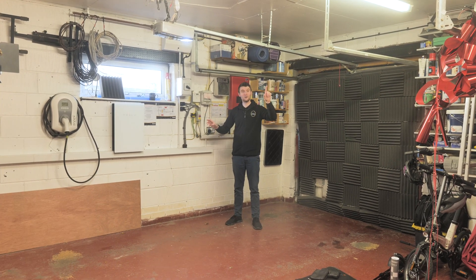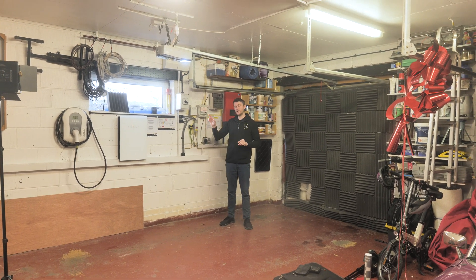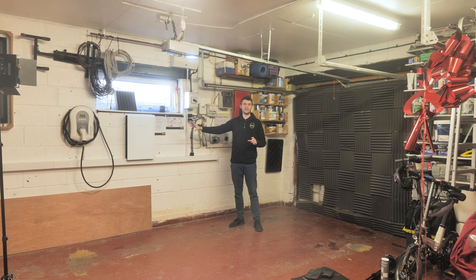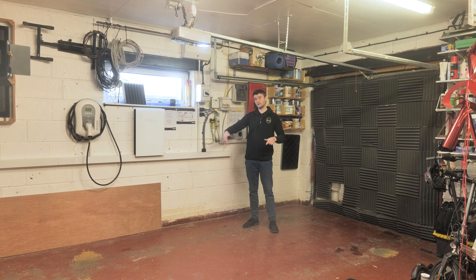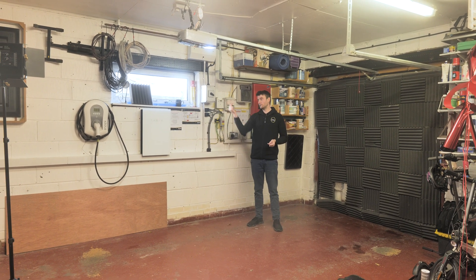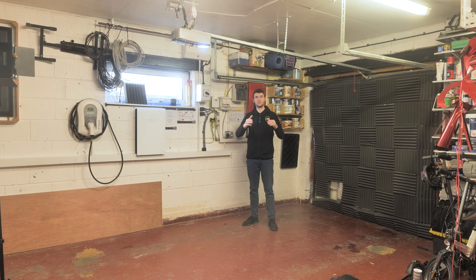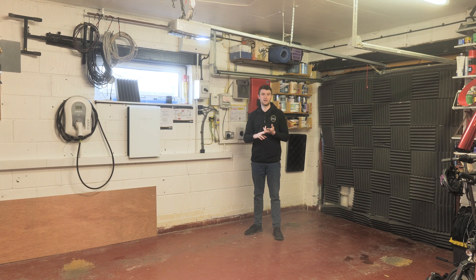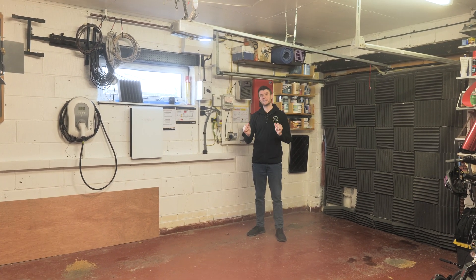That's clicked. It was so quick — the lights haven't actually gone off. That's fantastic. So now we are running in off-grid mode. I heard a click inside the gateway, so it has isolated the grid from the system and is now drawing power out of the battery to feed the house. The internet's probably rebooting — it might even have been so quick that the router hasn't even turned off. It's literally instant.